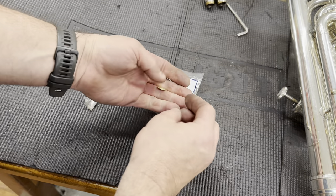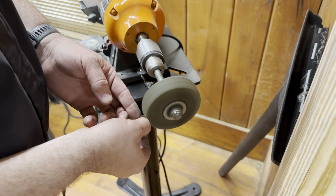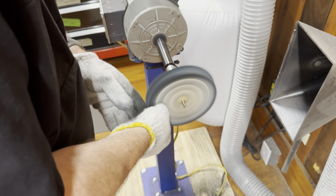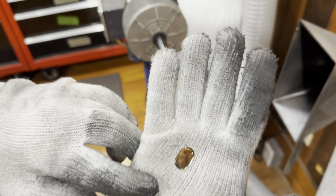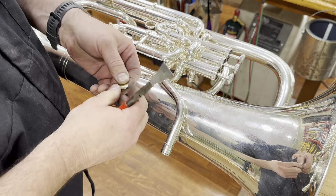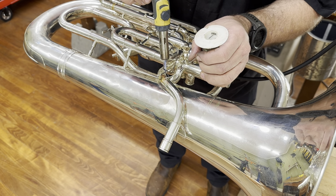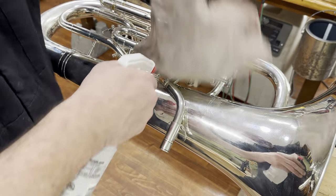For quick things, I like to use the J17 brass patches. We'll get the burrs knocked off of this and then we'll buff it. I like to use the R44 yellow buffing compound — looks really nice. Using the F97 duckbill pliers, I'll just make my shape, bend it around, conform it, and make it look really good and get it ready to solder in. For soldering, I'll use the J61 low temp silver solder — always does a very nice job on silver. Neutralize that flux.